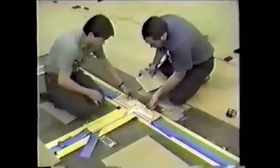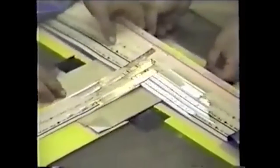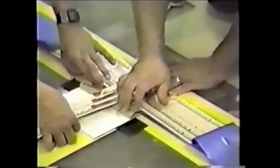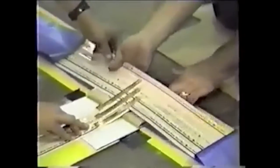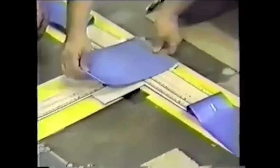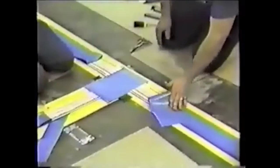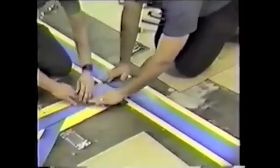An insulator patch must now be installed to insulate the termination. The insulator patch must be installed between the bottom cable conductors and bottom protective blue vinyl covering. Do not cut or remove the bottom blue vinyl. After the insulator patch has been installed, use the top blue vinyl that was previously pulled back out of the way and overlap it on top of the insulator patch.